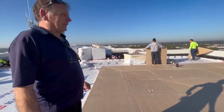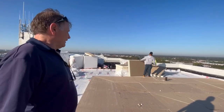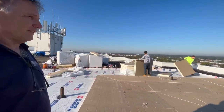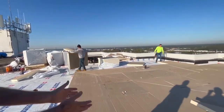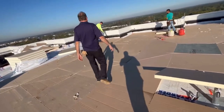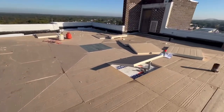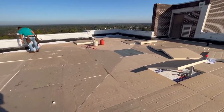I may not be the roofing guru, but I've been doing this for 45 years and tapered systems are a specialty I know extremely well. You can tell this is extremely well graded — if you were to roll marbles down here, they'd all go into that center drain point, which is really the goal with any tapered system.